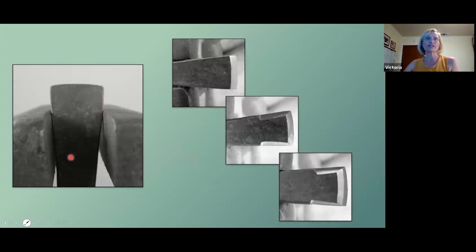And when you file it, you would start by having it upright in a post vise. And you'll notice this has a slight dome to it. It's probably about 1/16 inch higher in the middle than it is on the ends. Once you've got that, put your tool sideways in the post vise, or horizontal, and you're going to file off an edge and bring it to a point, like the tip of a little house. And the amount you're going to go back is dictated by how wide this is. This gives you a nice edge that's supported on both sides of the tool.